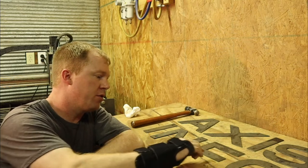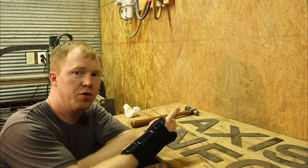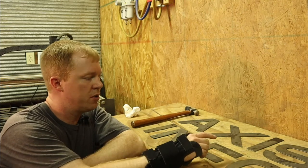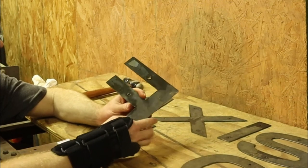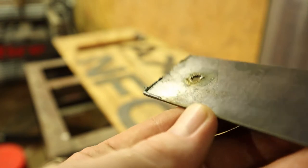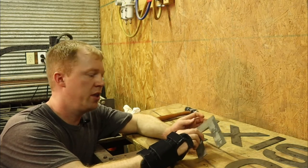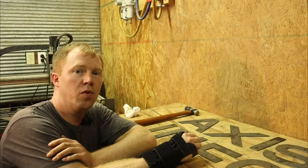To help prevent surface rust from these letters being wet, we're gonna move straight into the grinding room and work with a wire wheel. That's gonna do three things: it's gonna take the heat and water off of these to prevent rust, as well as prep the surface for paint. On the back, there are small layers of dross or slag from the cutting where that hot metal rolled over and slightly melted on it — and usually a wire wheel will take that off. Whatever's left, we'll have to take a chisel or hammer to finish cleaning and prepping it for paint.